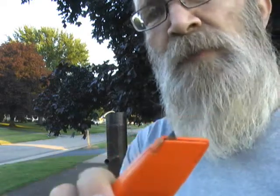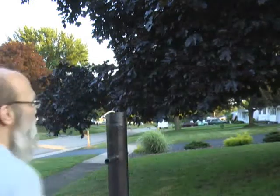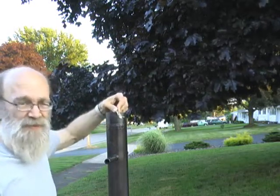No, we're gonna have to get a different knife. So we're gonna use the retractable utility knife here, which has a very, very sharp point and tip. And for safety, we're going to bring it back to only that far out. That way, if it does slip, I lose control of it and I do end up cutting myself, it's going to be a very shallow cut versus a very deep cut. Okay, now, this hand I keep behind where I'm cutting and in the opposite direction of the direction that I'm drawing the knife.